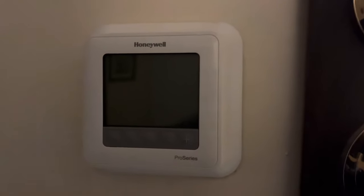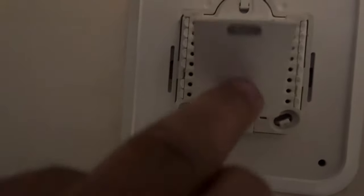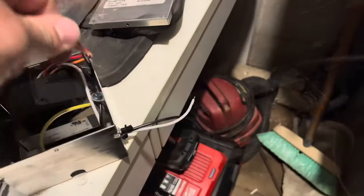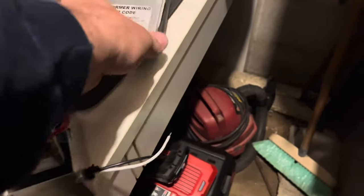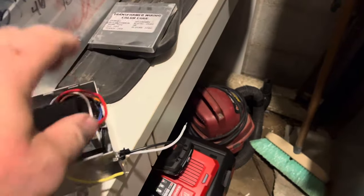There's no power here. Even though I do have the disconnect in the boiler room, there's no power connected. I'll be out in the boiler room checking - be safe. So I'm going to use this transformer, which I have from a UV light. It's got my 120V common and my 24-volt side. I'm going to need this, and then I'm going to need a RIB relay.